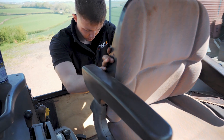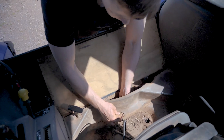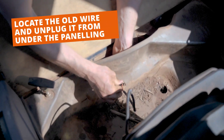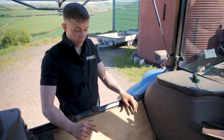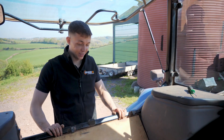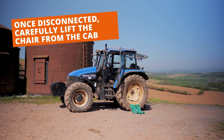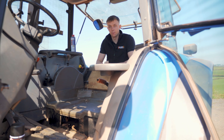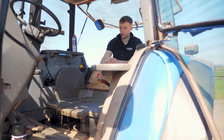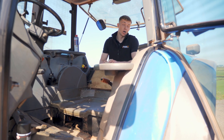Your old seat probably has some wires, so now we'll unplug the seat connector. Follow the wire from the seat down and under the paneling of your tractor. Now we're ready to get the seat out of the cab. Those old seats, even when they're knackered, can be surprisingly heavy. For your back's sake and general safety, we highly recommend this is a two-person job.